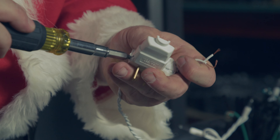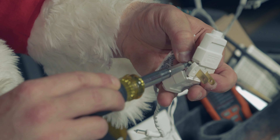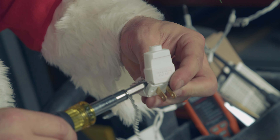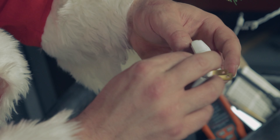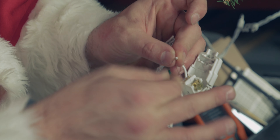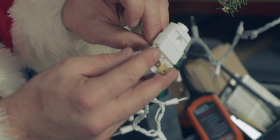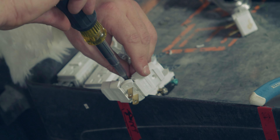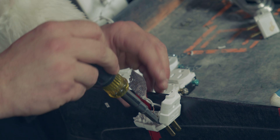You've seen in the 'how to install a receptacle' video that you loop the wire — hook it and pinch it, remember that? So you're going to wrap it around like so. It's very similar to how you would land a receptacle. You tighten the screw down, making sure you're wrapping in the same direction that it's turning so the wire gets in there good and tight. Take the wire, twist it, make a little hook so you can get it under that screw really well.